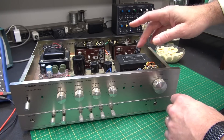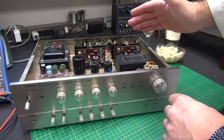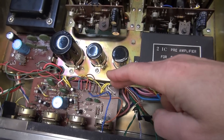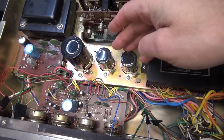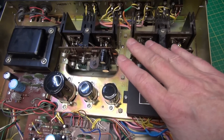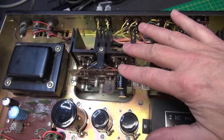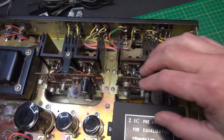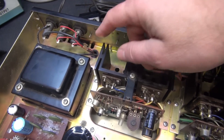I'm going to give you an inside view and then show you an easy way to determine which of the transistors on these output sections is defective. Here we have our preamp board, power supply filter cap, and the output coupling caps that go to each speaker. These two output modules go through those caps and see your 8-ohm speaker as a load. Over here is one of the power supply modules and the power transformer. This is my left channel and my right channel. The left channel is operational; this one is not — and one of the fuses is removed, which points at the defective channel.